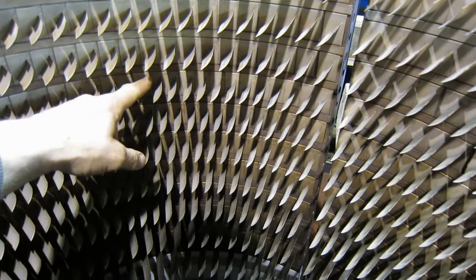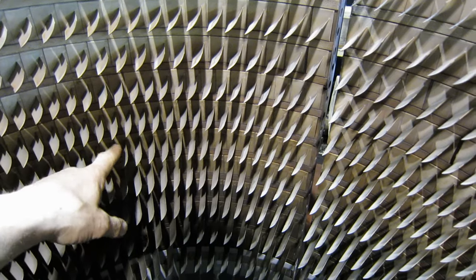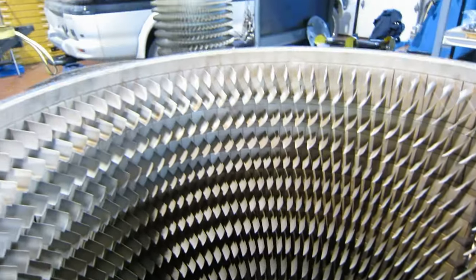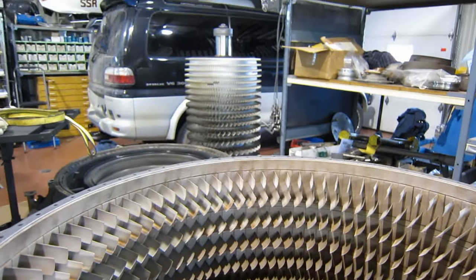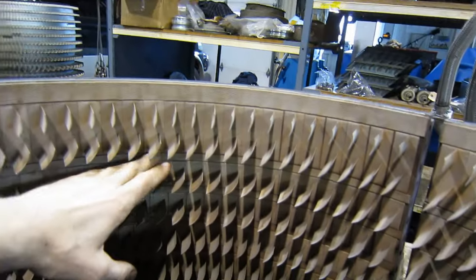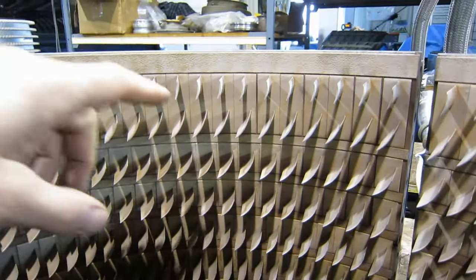The diagrams that we see don't show every stage of stator. There's a stage of stators behind every stage of the compressor rotor. Each of the stages of the compressor rotor matches up with one of these slots — except for this one.